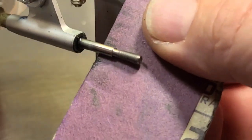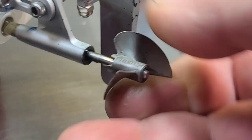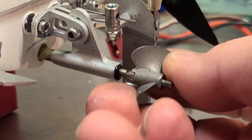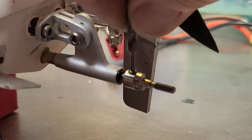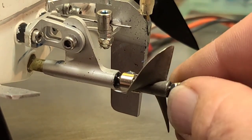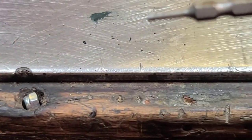I've actually had to do this to several boats — it doesn't take much, just a little bit. That's 120 sandpaper. Yeah, it's actually starting to go on there now — yep, that's perfect. I'm going to throw my drive dog back on there, got lock-tight on it already so should be good to go. Put our prop on — not much room for the prop nut on there, that's for sure. Probably one of the biggest props I can run on this boat, this is a 32.